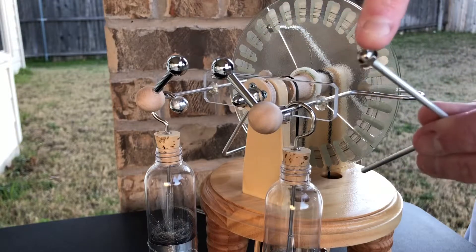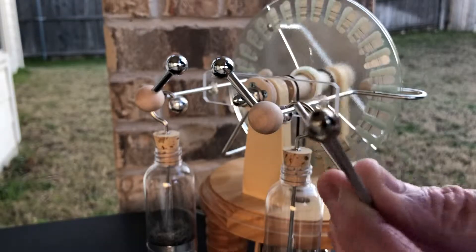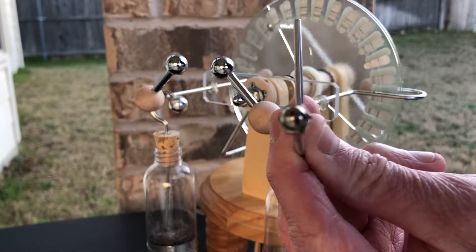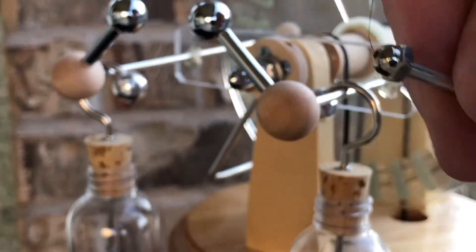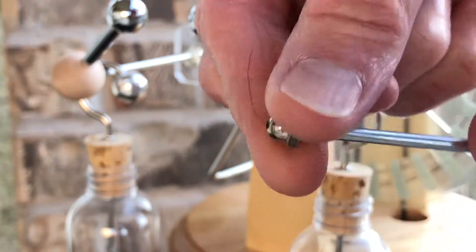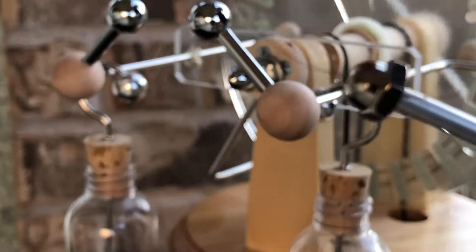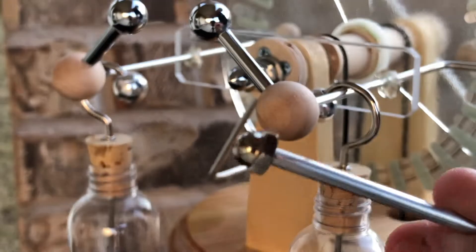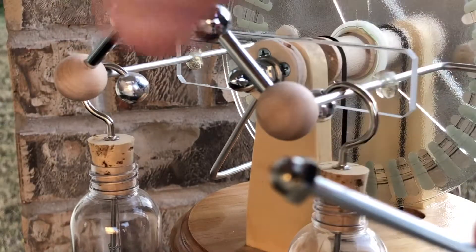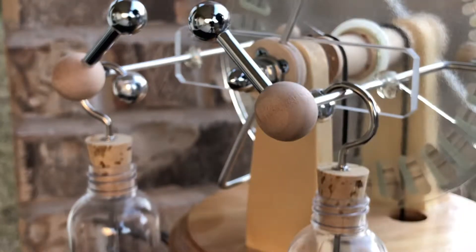The neutralizer bars actually come out of here. I threaded nuts onto the ends, drilled holes in the center of those nuts, and the wire actually protrudes out of there — the nut is threaded onto the rod and the wire is wound in there. It would probably be better if you cut a notch in the threads and put the wire in that notch, because as you screw the nut on the threads can cut the wire and the wire just falls out.